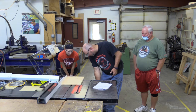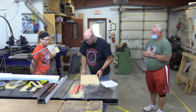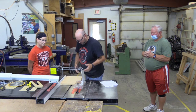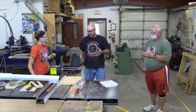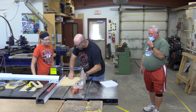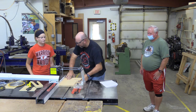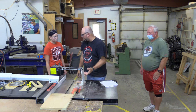To turn the switch on, all you've got to do is pull. And if you ever get uncomfortable, that shuts it off. To quickly review: lock your fence. I'm going to do this as a dry cut. Blade height is already set. Put the guard down. My body stance is diagonal to the fence — I don't want to be flat-footed. It's still an athletic stance. Your left hand — whatever's comfortable. Your right hand in the center of the board. If I push off to the side, watch how it comes away from the fence. But if I push here in the center with a left hand to back it up, and then follow through — you can tap the piece with your knee, whatever's more convenient.